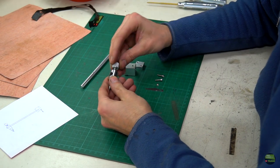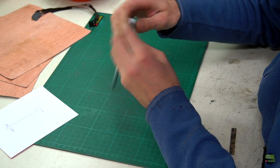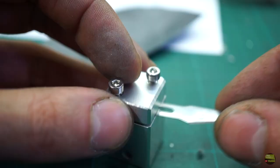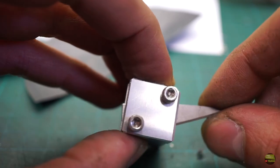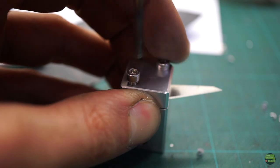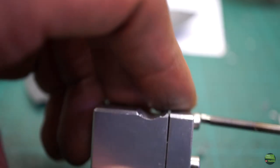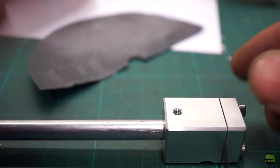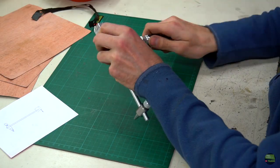There are just a few parts to assemble. First I screw the blocking knob into the tip and install the axis in its place. Then I install screws onto the knife holder and block the blade in place — I use a scalpel insert but it also works with a hobby blade. Then I just mount the knife holder onto the axis and lock it with another screw. And that's it — my circle cutter is ready to use.